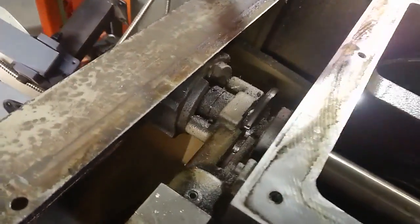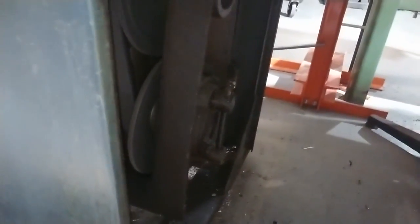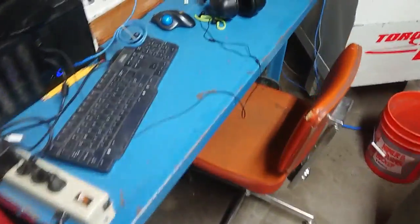Let's go back to the variable speed — I'm going to turn this on again. As you turn this, it starts moving this cam mechanism right here. That cam mechanism actually sits there and rotates. If you turn the speed adjustment while this thing is not rotating you will screw it up, which is why it says so on the handle. So that's the internals of a Clausing 1500 lathe: read your manual before using and understand the machine before you use it.